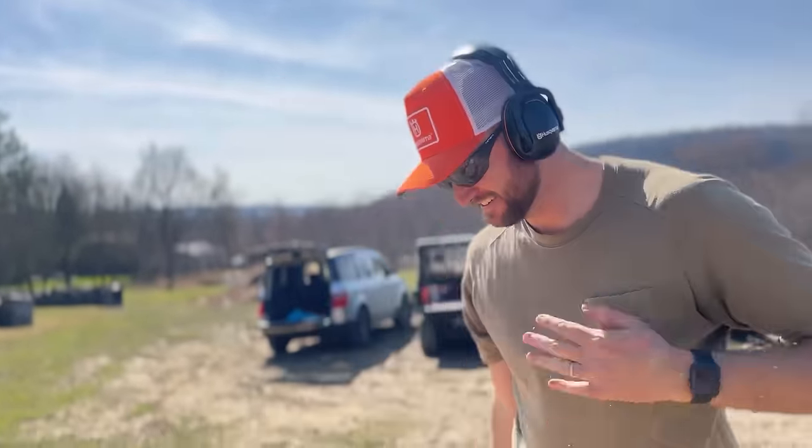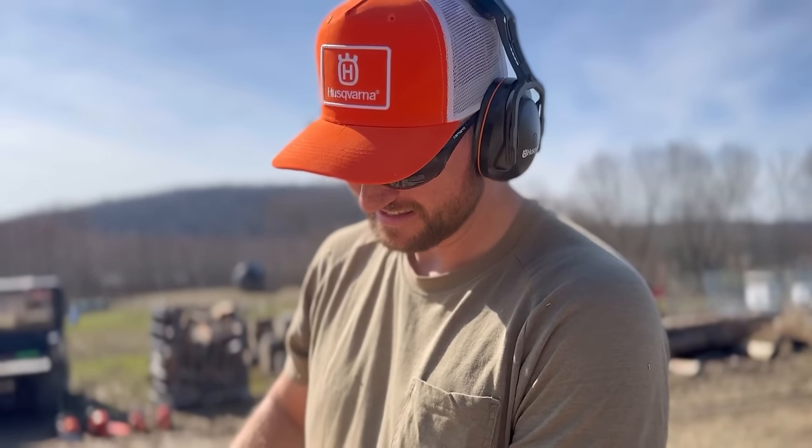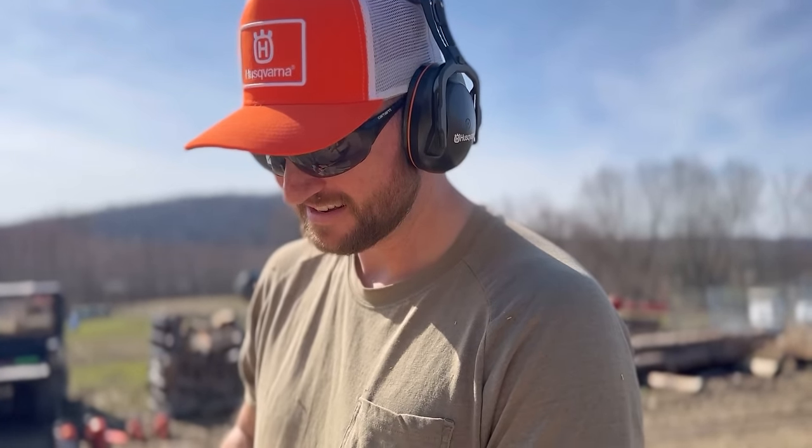Biggest log again. Yeah, and your rakers are a little aggressive, I'd say. Yep. Yeah, that Stihl 2-in-1, not sure that I'm a big fan of it yet, because every time I've used it, it always takes my rakers down too far. Yeah, it's biting pretty hard.